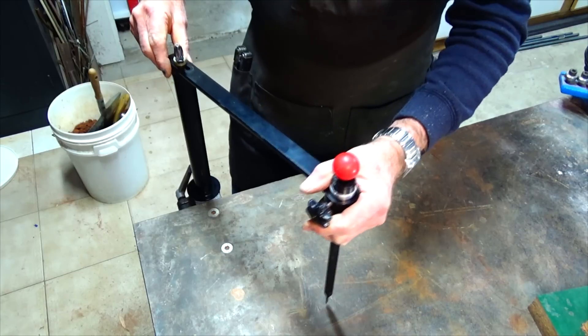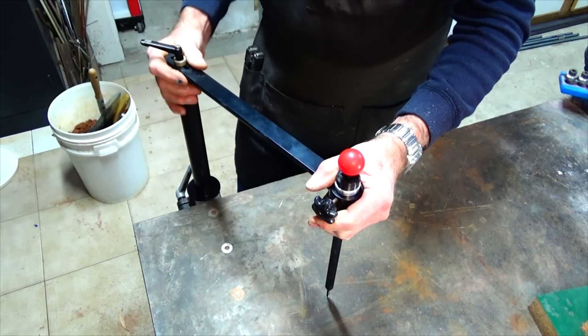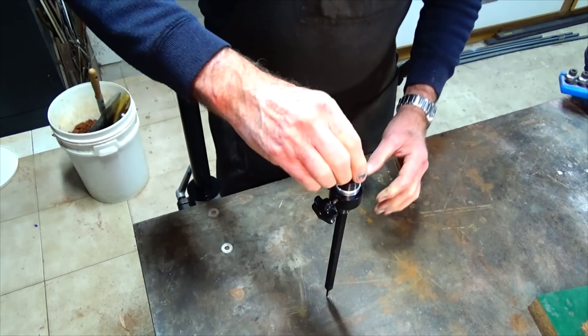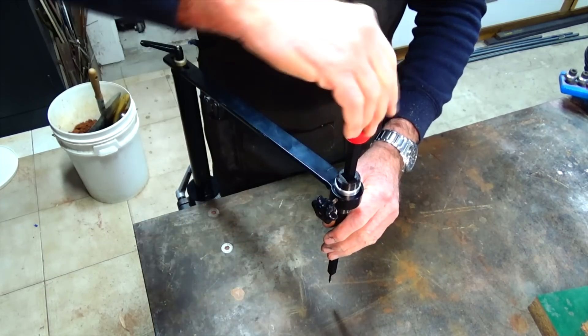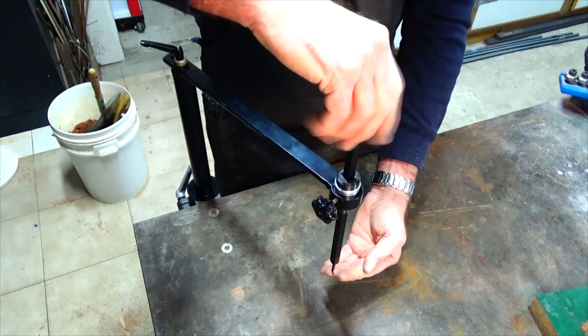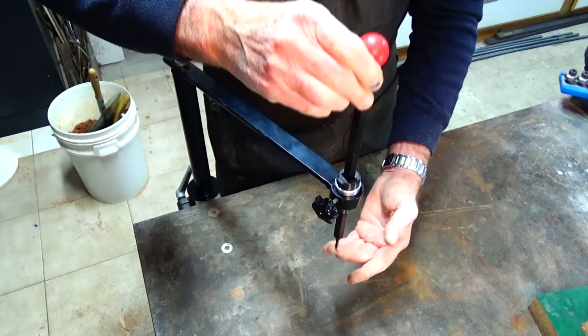You need it to be adjustable but also able to be locked so everything is tight and there's less chance of anything moving at this end. That bit of square steel bar is free to move up and down, and I've got a clamping knob so I can also rotate that square steel bar — which allows me to drive the screw into the pattern and then lock it, while it's still free to move vertically.